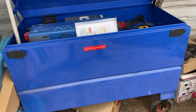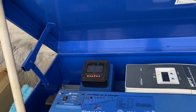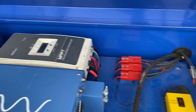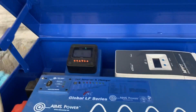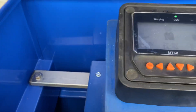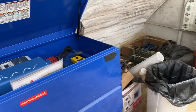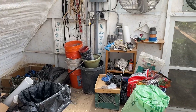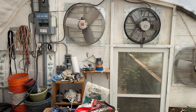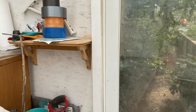It's a 6,000-watt system — a pretty slick little setup. Everything is right here: the batteries are on the bottom shelf, and the top shelf has the inverter, the charger, and the charge controller. This little monitor is how we know how we're doing, and it's showing a full charge. When the big fans go on to cool the greenhouse on these hot summer days — we're about mid-90s to 100 today — we see a minimal drawdown, which charges back up very quickly.